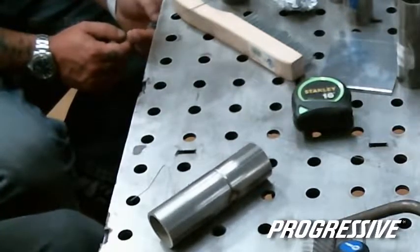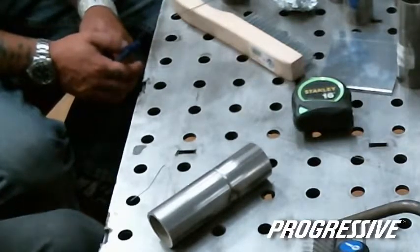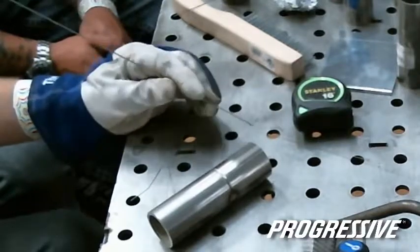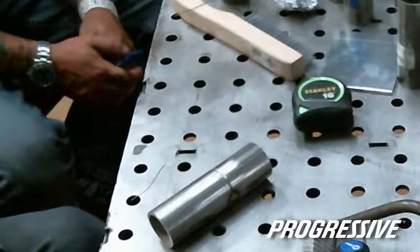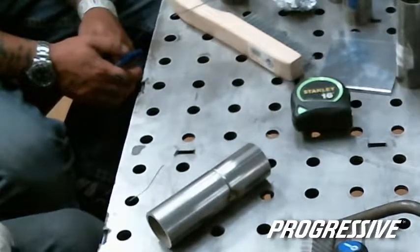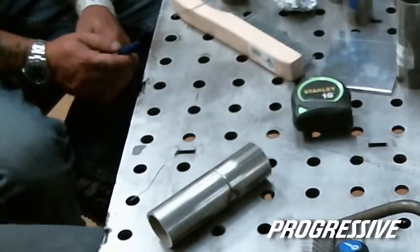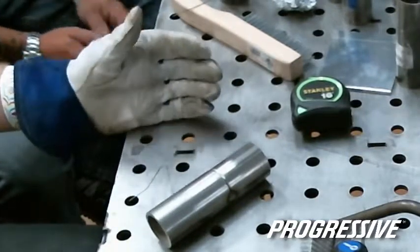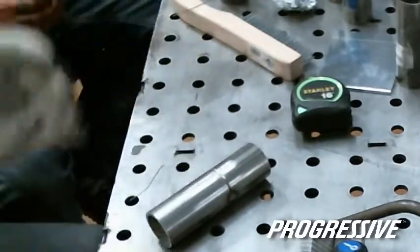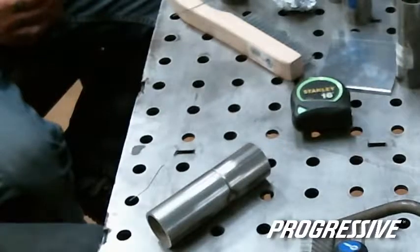So you'll quarter point it, and then maybe I'll run a weld standard, and I'll run a weld with pulse. And with pulse, to get a proper weld, you're going to increase the amperage quite a bit. Pulse goes to a full amperage of what you're set at, and then this machine has a default setting, so you can't really fine tune it. There are different grades of machines with different options. A default setting of 50% means over the course of half of the time it's on, 50 and 50. So if you're at 100 amps, it'll drop down to 50, and if you have it set at 1 second, it jumps up, down, back up, down.